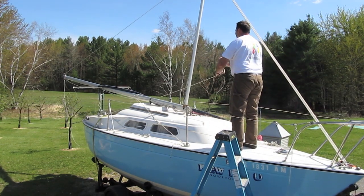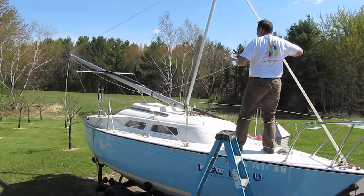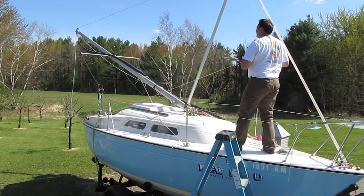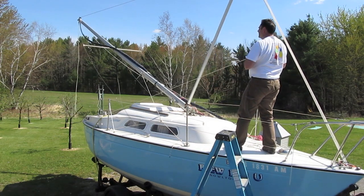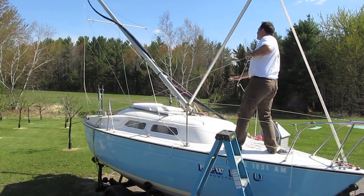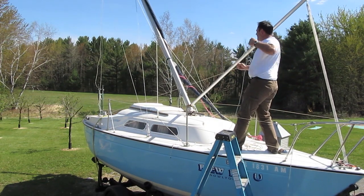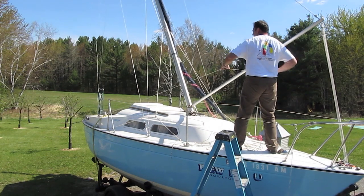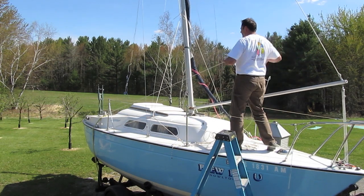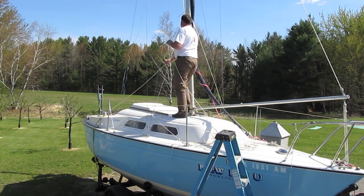The initial pull is fairly substantial — I've got to lean into it a little bit. If the mast wants to move one way or the other, you can just grab the 5-to-1 lines right behind my right shoulder and move it either way a little bit if you need to center it. It's still a pretty substantial pull — there's probably 30 to 50 pounds of pull required, and using a winch handle on the winch and having someone turn that would most likely make it a lot easier.